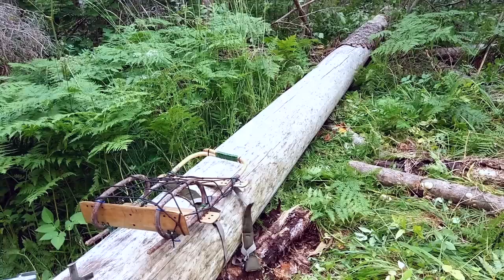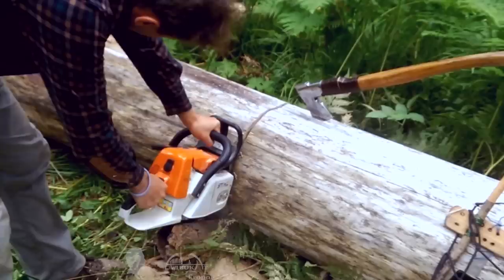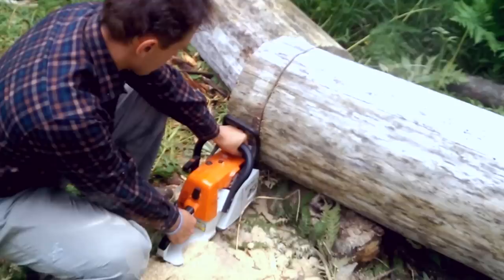I dropped this dried pine on a few skinny logs that I laid out in advance. This way, it will be easier to mill the door slabs later. I have two doorways in my cabin, so I need to cut four wide slabs for two doors. I cut the slabs longer than needed, as you can always cut them shorter.